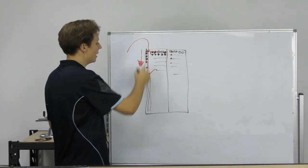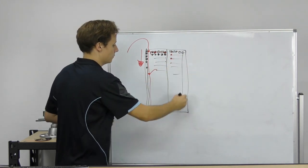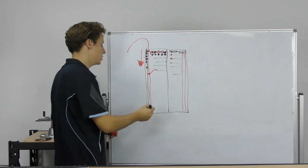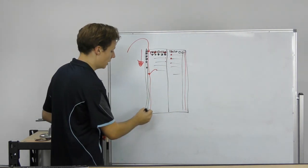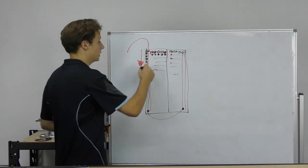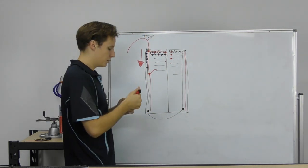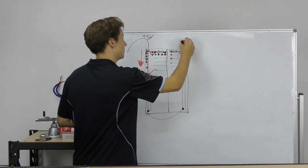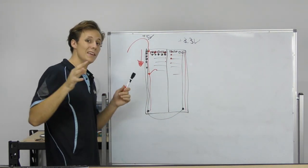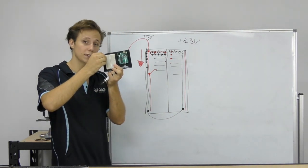Very handy, and likewise, the black line allows you to connect ground. And there's also going to be one on this side, but these are again isolated from each other, so they're not connected. So you could have one voltage here and another voltage there. You might want to have common ground, so you would run a jumper wire, let's try black to make it all consistent, over to there so that your grounds are the same, so you can connect both sides to ground, but you might have 5 volts here, and then take the 3.3 volt tap from your Arduino board, perhaps, if you have components that run on 3.3 volts. Really, really cool. Now, be warned, something that tricks people every time, a half-size breadboard like this, the power rail is connected all the way down.